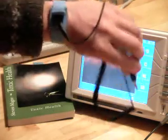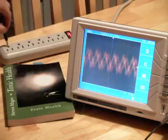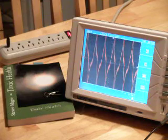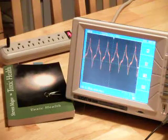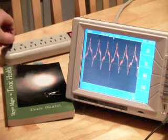Let's get on with our anti-static strap and see what happens. Right now I'm still electrically insulated. I'm now going to put this pin into the ground socket on the strip. So that's what my body voltage changes to. As you can see, there's quite a high voltage on the grounding connection, and that wasn't there before I plugged into it. We're actually set on 200 millivolts per division and we have almost five divisions — so that's about 1 volt peak to peak on the body when connected to the grounding strip.